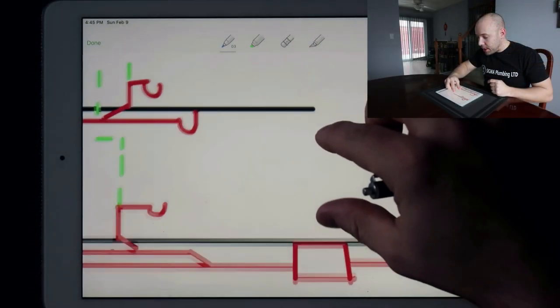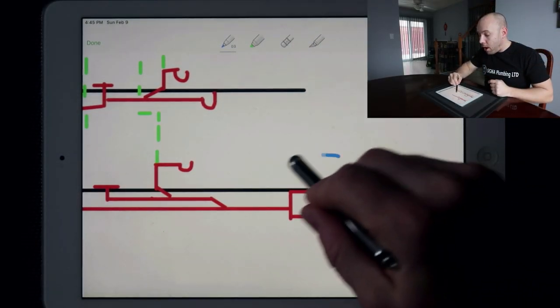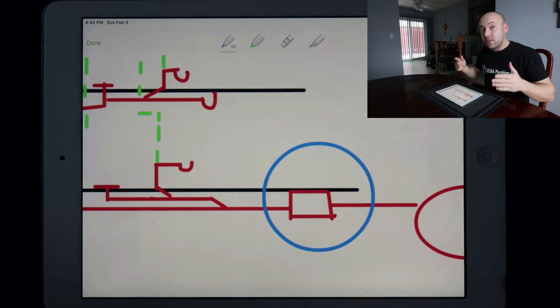Because if anything starts to happen, like they start to see water come out of the basement floor, what the family will do is essentially put in the other preemptive measures, which is not run any water in the house, because they know that by running water, they're adding to the load, and that load isn't going out into the sewer, it's actually coming up into their basement, so everybody's gonna stop running water altogether. So in this regard, it makes a lot of sense to actually install a backwater valve on the main line like we did in this video right here.